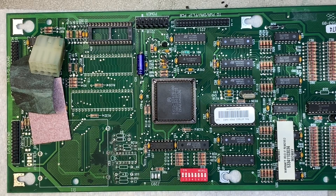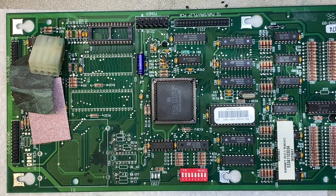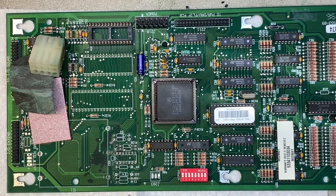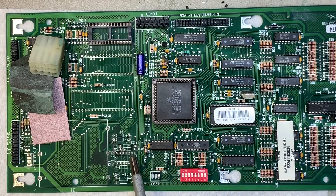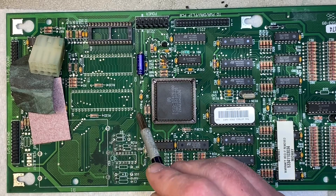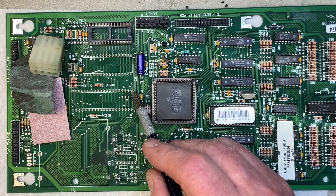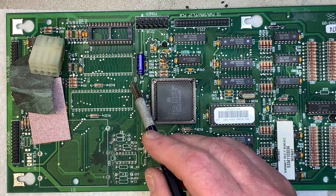I removed the remaining leg from the back side and cleaned out as many of these holes as I can. Sometimes the corrosion prevents you from cleaning them out very well. Here's the real meat of the corrosion — it's gotten down into these pads, making them unreliable, and also into pin 21 of the processor and pin 14 or 16 of the game ROM.